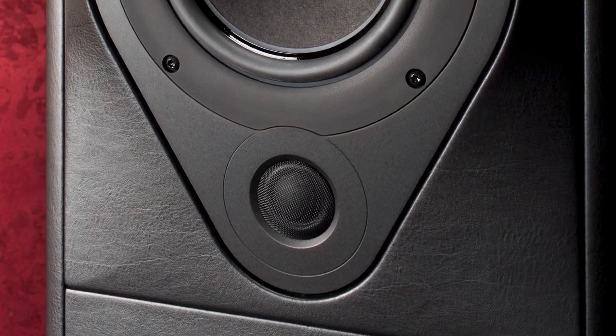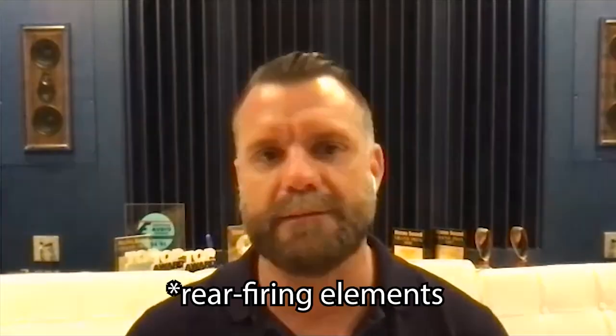So in the current SE17, how are the drivers designed in-house? Not exactly, because the woofers and subwoofers are still the same ones from the original Sonus Faber Fenice. They have diaphragms and some other details, such as the moving coil of the subwoofers, which have been designed by us. But it's not a complete Sonus Faber new design — just a heavy tweak of an existing design. While the mid-range of the original Fenice was already 100% a Sonus Faber design, like the new one, like the new tweeter, and like the rear-firing units as well.